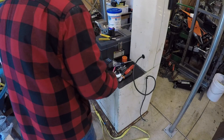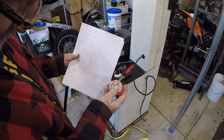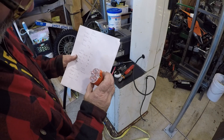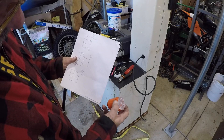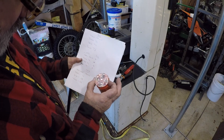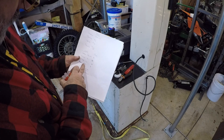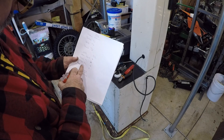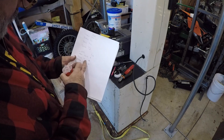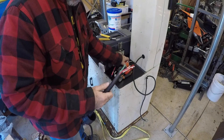The plug is labeled with X, Y, W, and a ground. I can see two copper screws. I'm assigning X as T1, Y as T3, T2 will be W, and ground G is ground. That's how I'm wiring it up. This cord is 10-10-3.